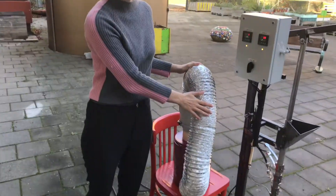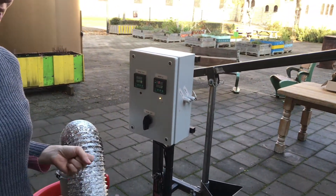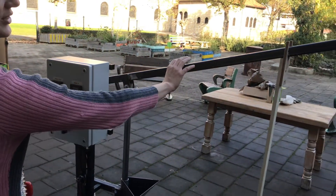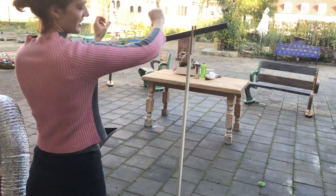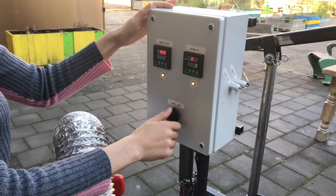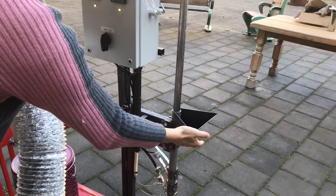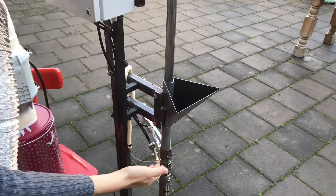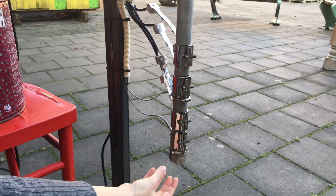Here we have the filter system and here we have the injection machine. When you start off, notice that you put the lever in the lever holder. But later when you're going to do the pressing you're going to remove the lever and move it downwards. Furthermore we have the control box with the main power switch, and here we have the hopper where you insert plastic. Going down we have the barrel with the heating elements, and at the bottom we have the nozzle where the plastic comes out.